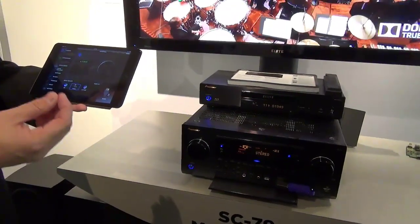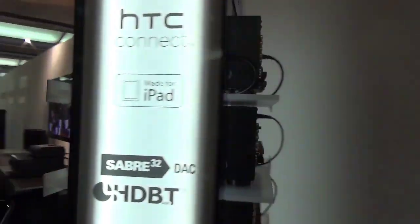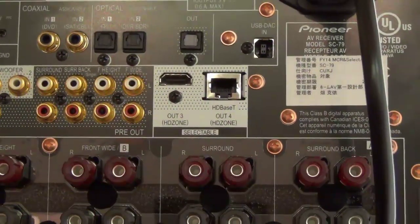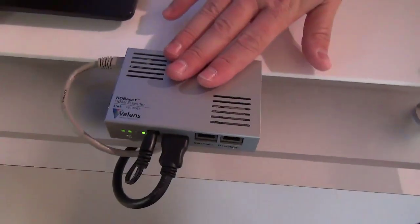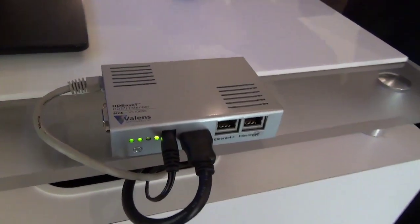HDBaseT presents itself from the receiver as an Ethernet output, but that Ethernet jack allows me to run a high-definition HDMI signal up to a hundred meters in length. And I'll show it to you on the model over here — it allows me to push this high-definition HDMI source all the way across the house using a simple Ethernet jack. So once connected, I now have the ability to choose whatever source is available in the living room to play anywhere else in the house. Over in the extra zone room, we'll have an HDBaseT receiver that converts the Ethernet jack back into an HDMI source.